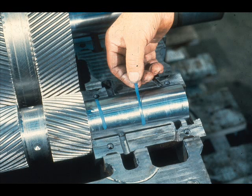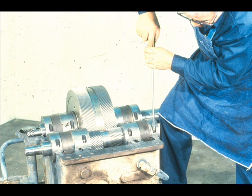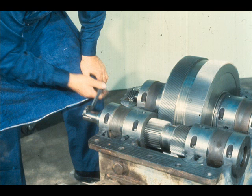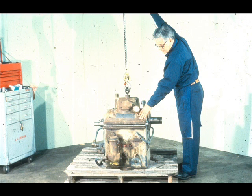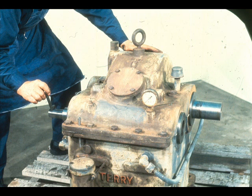After completing your checks of bearing clearance and alignment, remove all of the plastic gauge from the journals. Now apply more lubricant to all of the shaft bearing journals, then replace the top halves of the bearings and tighten them down securely. With the bearings in place, rotate the shaft manually to check for any binding. This will also serve to distribute the lubricant over the bearings and shaft journals. Lower the cover back onto the case and secure it with the bolts. Repeat your check for binding by turning the shaft manually again. If any binding is detected, it will be necessary to locate the problem and correct it. Now check the thrust clearance again to make sure it has not changed from the measurement taken earlier. If it has changed, the cover will have to be removed and the cause of the change determined.